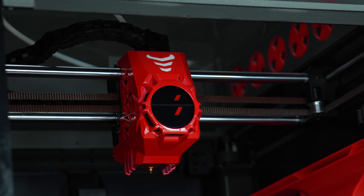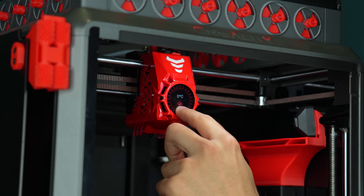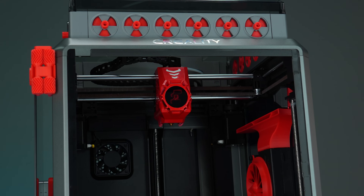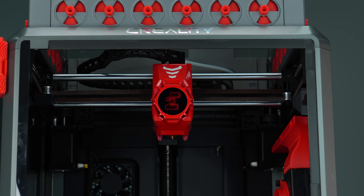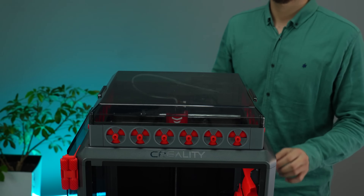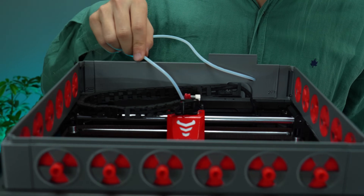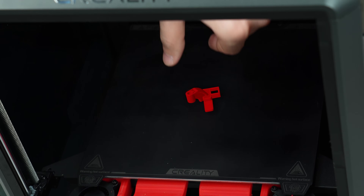This screen is the Nomi V2 by Beekoo — it has a nice touch screen with a customizable UI. You can add your own graphics for better aesthetics and better printer control directly on the extruder. As long as we have more space on top of the printer with the K-Riser, let's also make the bowden tube more straight to minimize filament friction.